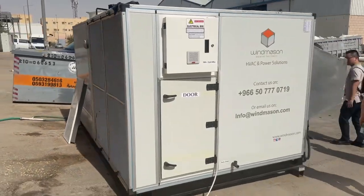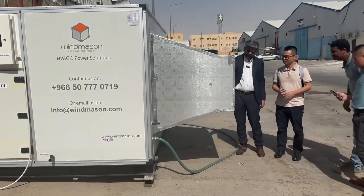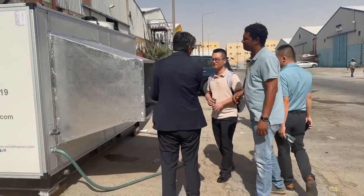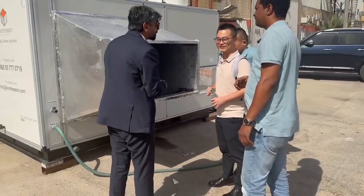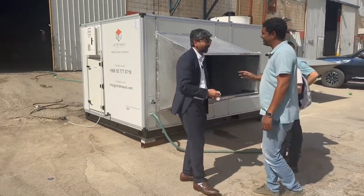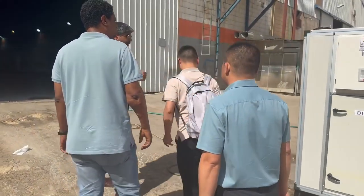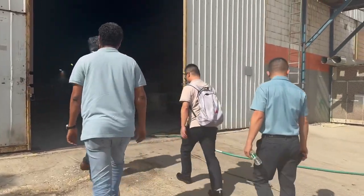On the back side of this, there is a cooling pads. I will show you inside. So there is a cooling pads, and then we can make it more cooler. So the bottom result is here, 15, 14, 16 centigrade temperature on the mouth of the unit, and 100% fresh air. Yes, we sense fresh air. Good. 25 ton, 10,000 CFM, consumes only 5.5 kilowatt energy.